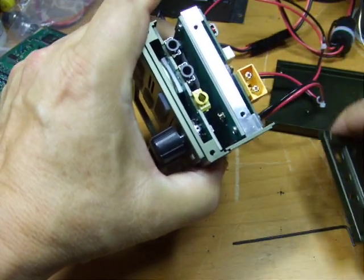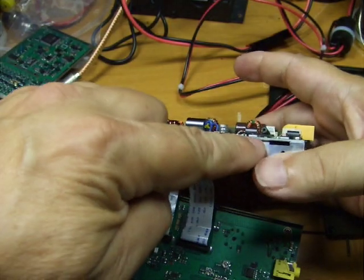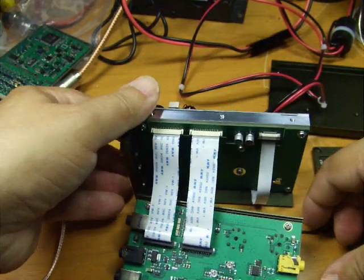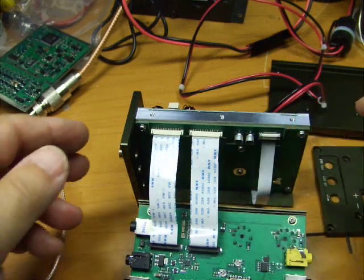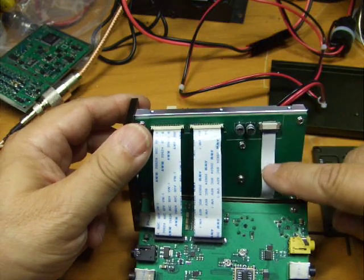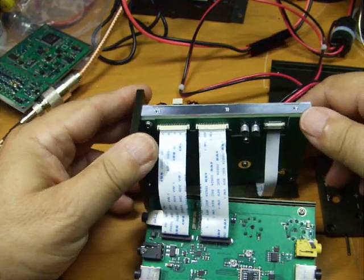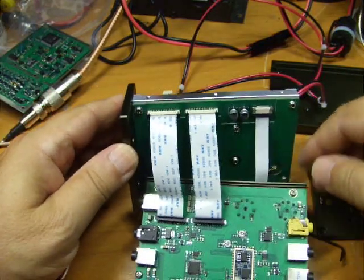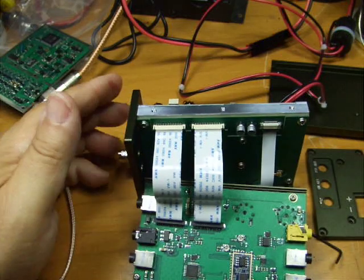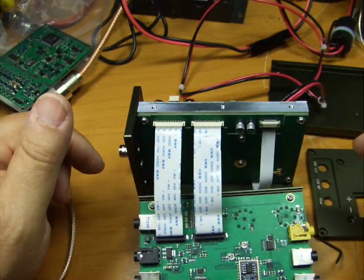With that out, I can take this side panel off and separate this. The RF deck is bolted to this metal frame, which is nicely machined out. I'm not going to totally disassemble it right now, but the board that was changed out is the one with all these ribbon cables. BG2FX had sent me two fresh ribbon cables, but there's this one ribbon cable that stays behind — the ribbon cable that goes from the main board to the RF deck. The process of removing the board involved taking out a half a dozen Phillips screws, separating this board from this frame, putting the new board in, and very gingerly replacing these ribbon cables, as well as this ribbon cable, and putting this whole mess back together.